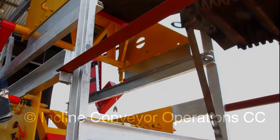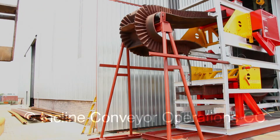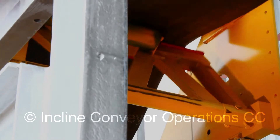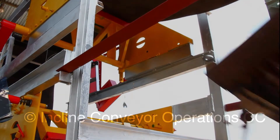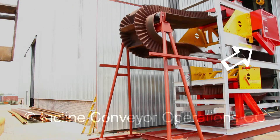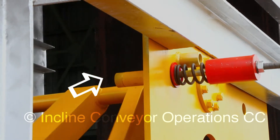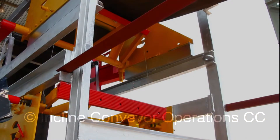Let us watch that in slow motion. The belt is cut manually. They catch both the top and bottom conveyor belts within 0.3 of a second. Notice the counterweights drop and the P-Lock system that disengages the bottom arrester, which allows it to catch the return belt instantaneously.